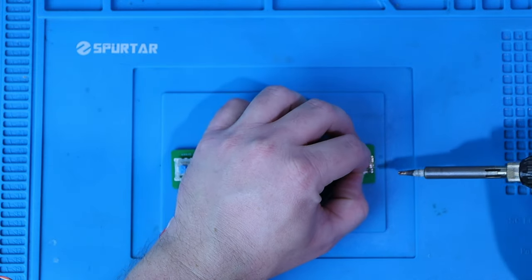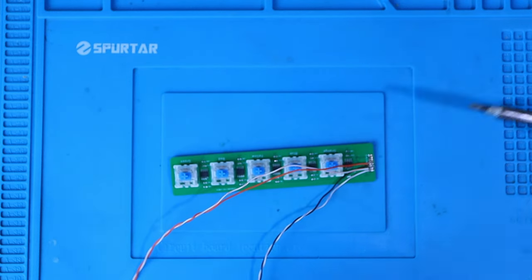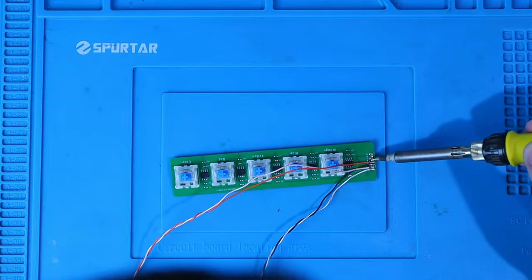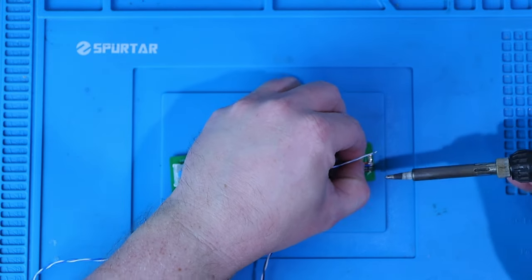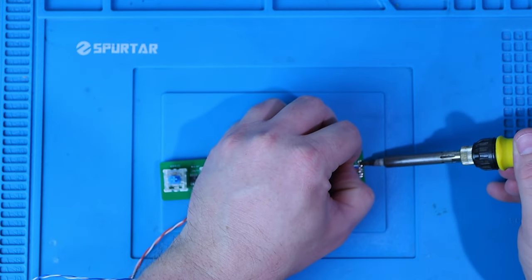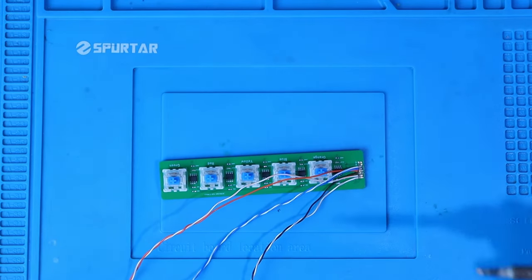If you decide to build one of these and you don't want the LEDs, you can leave out the signal and 5V wires, as the switches only need a ground and their corresponding signal pins to function. I've used a bit of Cat5 network cabling for my neck wiring since I had some here, but any thin gauge wire you can get is fine too.